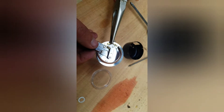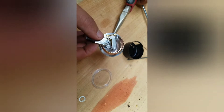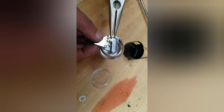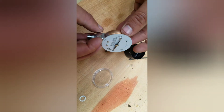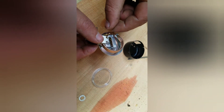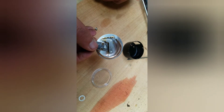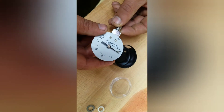If we look in this mechanism here and get the long nose pliers — if we were to crush this down it'll extend it, pushing that back to zero. That's what I've done to fix this. If we needed to go the other way, we could compress it and that'll take the reading the other way. If you go too far into negative you'll need to pull that back together, and opposite for the other way.